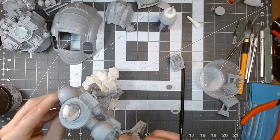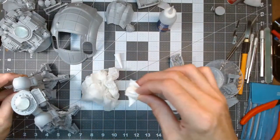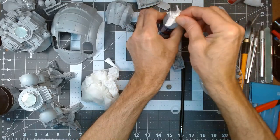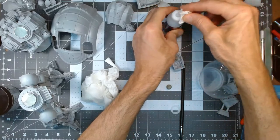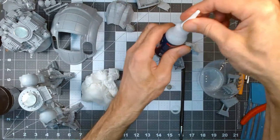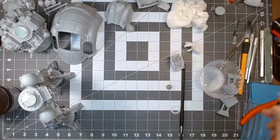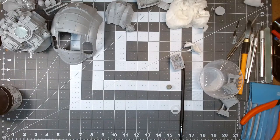All right, that's good. Top magnet didn't move. Now, let's clean off the super glue. You gotta be careful. I've had the super glue wick through the paper towel really quickly and super glue my fingers to the paper towel. So, try to watch for that. All right, now, a little zip kicker on those two real quick.